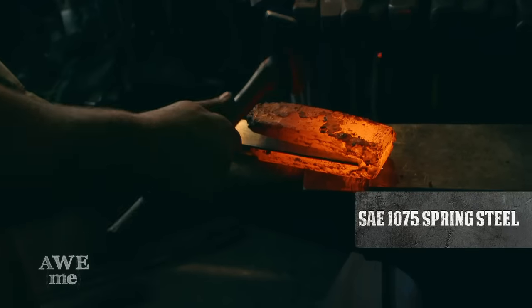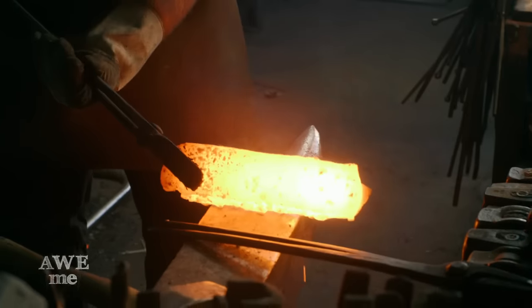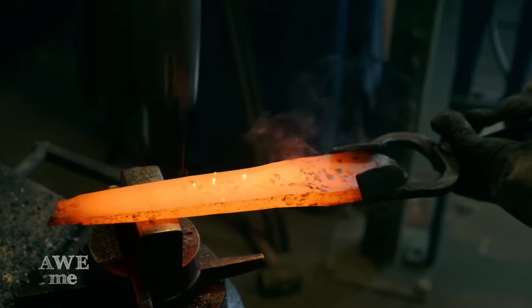I've just folded the 29 layers on themselves with a piece of 3/16ths 1075 steel in the middle, and then I'm going to laminate two pieces of 3/16ths 1075 on the outside, which is going to add a higher alloy steel to the iron meteorite that was causing the billet to crumble. That brought my initial layer count from 29 to 32 layers, and then I folded that three times to come up with 96 layers. Folded that again and again afterwards, so we're now at 384 layers. It is holding together, it is forge welding, and we'll make it into a sword blade soon.